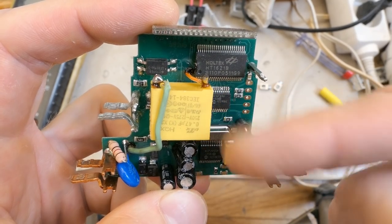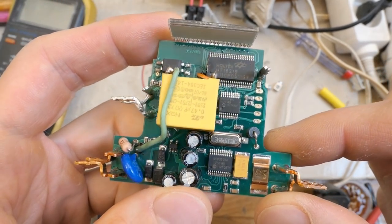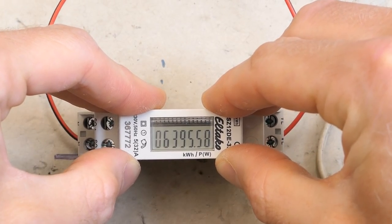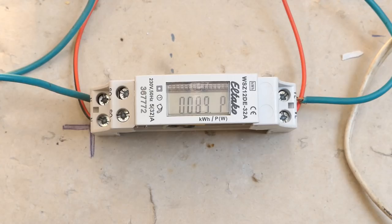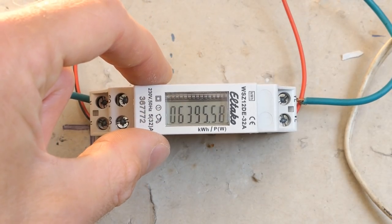Let's try to botch this one in. The capacitor is botched in horribly — I'm not going to install it permanently, it's just for demonstration. And now the display looks definitely much better; it's not so faded as before. And now it also measures the power consumption — it shows 89 watts.